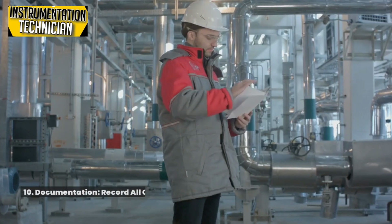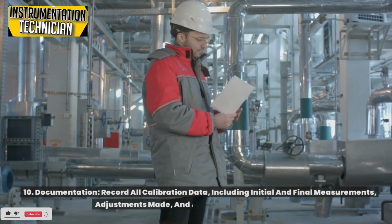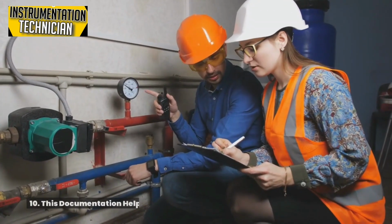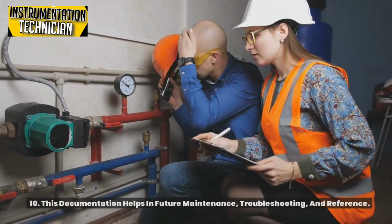10. Documentation. Record all calibration data, including initial and final measurements, adjustments made, and any notes or observations. This documentation helps in future maintenance, troubleshooting, and reference.